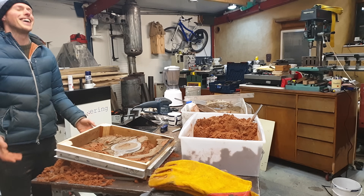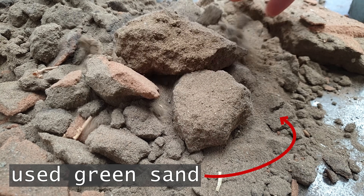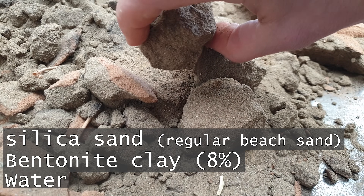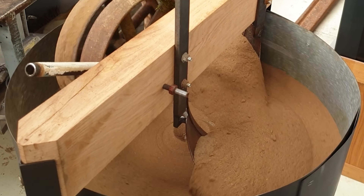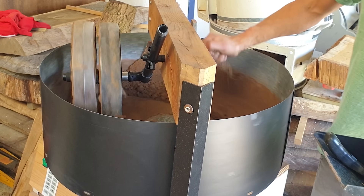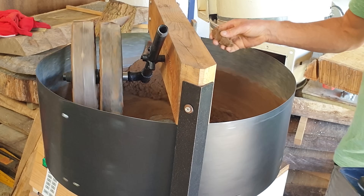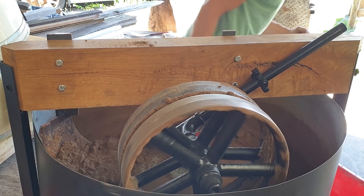There are a few easy tricks to avoid complete fails as well as partial collapses in the green sand. It's made up of three simple ingredients: silica sand, bentonite clay, and water. Getting these in the right proportions is simple, but we've certainly managed to muck it up in the past. One tip is to mix the sand and clay dry so you can weigh it, and another is to top the clay up every now and again because it does get burnt out with use. The water's just misted on until the sand passes the so-called sausage test, where you make a sausage shape and it doesn't break under its own weight - and when it does break, it breaks cleanly. You can do all this by hand; it just takes longer.